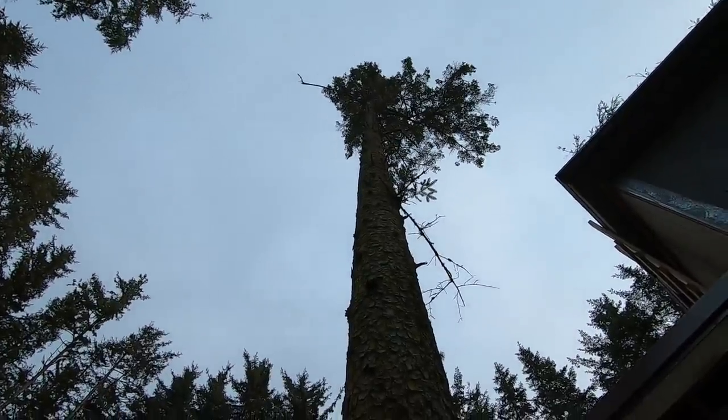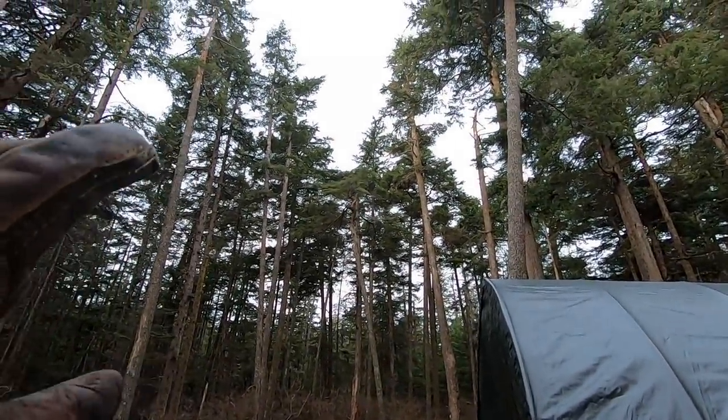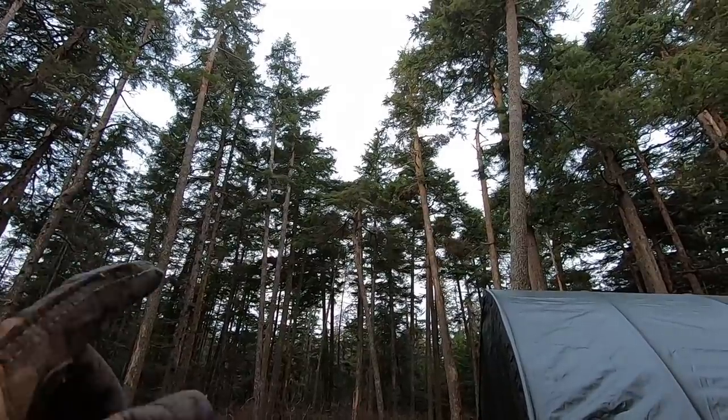This is our first tree here. It's leaning in the direction we want it to go, but there is a 15 mile an hour wind coming from the northwest. So we're going to hook this tree up to a winch just to make sure it falls in the right direction and a gust of wind doesn't push it back on us and fall on the house. That'd be a bad thing. Whenever I cut trees that are really close to the house, I always hook it up to a winch to give it that little extra motivation to go the direction we want.